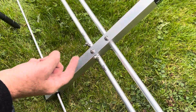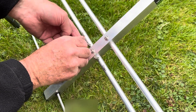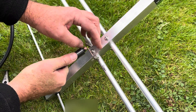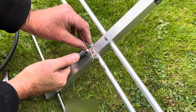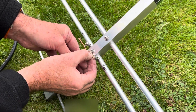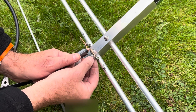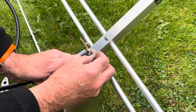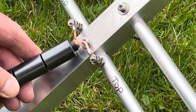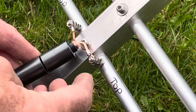I've got some ring connectors loosely on top of the dipole connectors. It's a case of offering up the coax so you know where to cut. You can see the center — I'm going to cut there and there. This needs to be flat like a T — when you come to solder, keep them in the same plane otherwise you'll have to twist them. I've trimmed the coax ends — they just need soldering. When you take the ring connector off to solder it, remember it will pivot, so keep it flat.